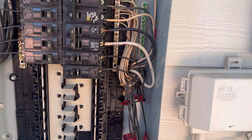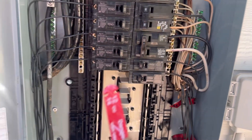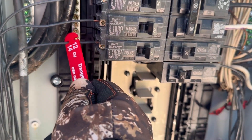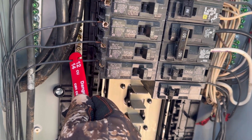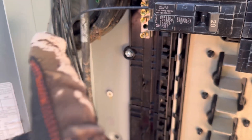There are various ways to verify wire size. If you can see the jacket, you can verify the wire size, but sometimes you've got a spaghetti bowl of stuff going on and it's hard to tell, so these testers can be a really cool tool. When I do this and take a photograph in my report, it shows the breaker and the wire and gives a clear representation of what is wrong. I also want to talk about this bushing where the service wires are coming in — this is metal and it needs to be bonded as well, so there needs to be a bonding lug attached to it and tied in with all of the grounds.